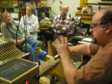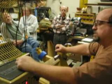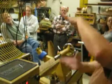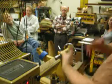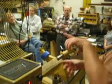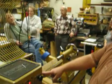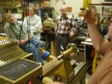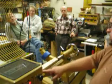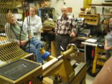But anyway, on various websites they show you the safe RPMs. The RPM at this point is different from if I've got a bowl out here. It's different from the RPMs out here. There's some sort of physics or science about that. The surface is going faster, but it's the same RPM, just a greater distance. But basically what they say is if you're measuring, say, 500 RPM at the shaft, then I can make judgments about whether I need to slow it down or speed it up based on how rough the wood is.